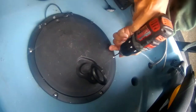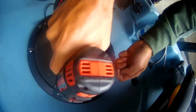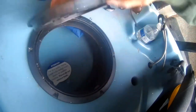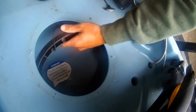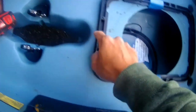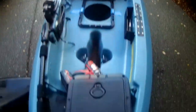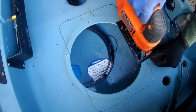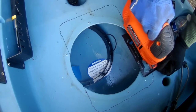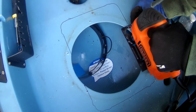Remove all the screws and save this for later — we're going to install it in the front. After we get that removed, it just pops off and has a little back brace for support, we'll use that later as well. Make sure your scupper holes and your drive slot are clear — that's the only kind of sketchy part because it runs kind of close. You don't want to drill or cut through any of that stuff, so make sure it is centered in between the scupper holes and the drive well. Measure twice and cut once.